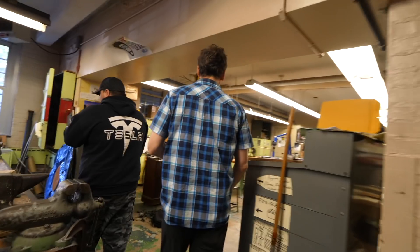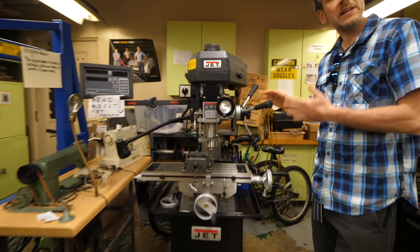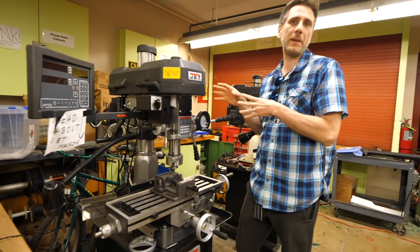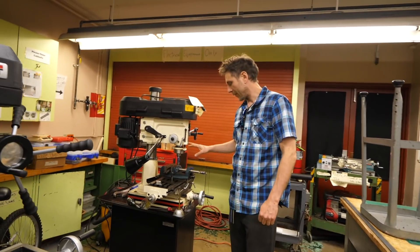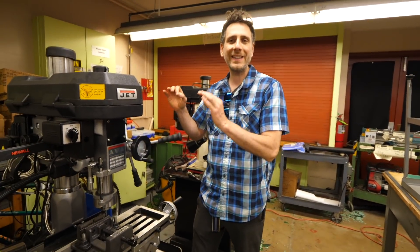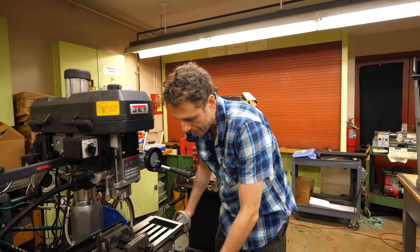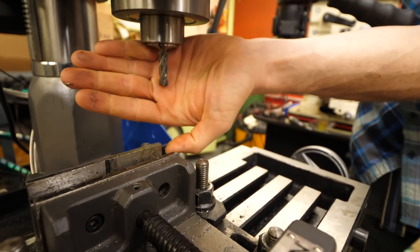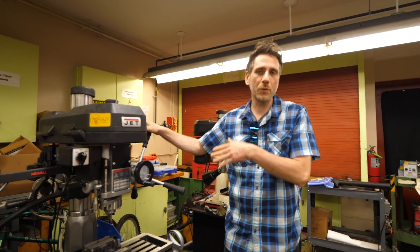The shop is really diverse — we have milling machines. These are miniature mills. If a teacher or hobbyist is watching, this Jet mill is designed in the US but made in China — it's bulletproof, it's teenager-proof which is even better. Teenagers have been working on this for about three years. If you don't know what this is, it's really simple — everyone knows about the 3D printer; this is the 3D cutter. You can cut in three dimensions — it's like a drill press. That's your Z axis, but you can also go front, back, and side. The cutter looks like a drill but it's an end mill — way harder steel than a regular drill bit, but if you go too fast you can crack it like chalk.